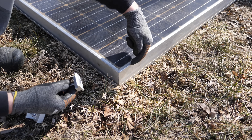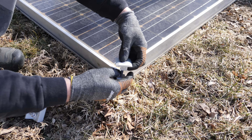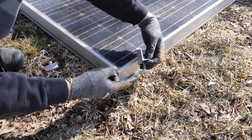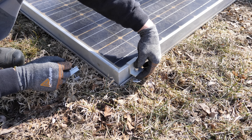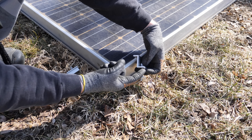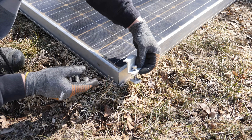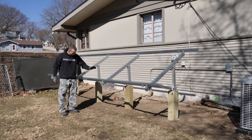The reason I'm not putting panels on at the moment is the sides of these Sanyo panels are about 70 millimeters thick and I need to get some longer bolts. I'm probably also going to have to find different end clamps because it's such an odd size panel. You want the edge of the Z-bracket to be touching your rail so that when it clamps down it's at the correct angle. So I have to find some different end clamps for these specific panels.